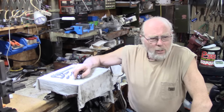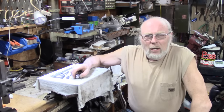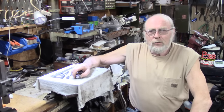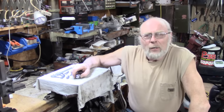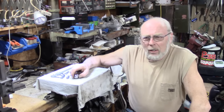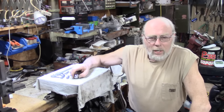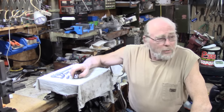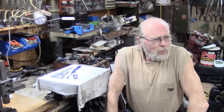As I mentioned earlier, and I'll say it again, the chip formation was basically fairly clean. It wasn't scratching, it was actually making a cut. And during those last phases, assuming I haven't got one completely lost because of focus, we'll have to see. The chips coming off were very good, and as the sphere gradually grew, in other words, the machined area got bigger, the cut seemed to be getting smoother, and I'm going to go with that. I think the next ball I make will be the same basic method.